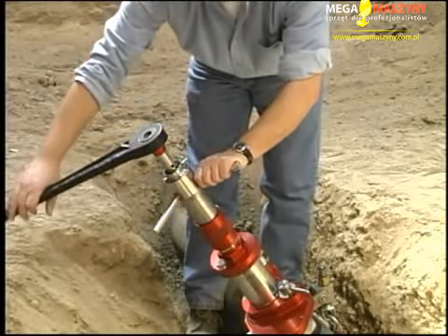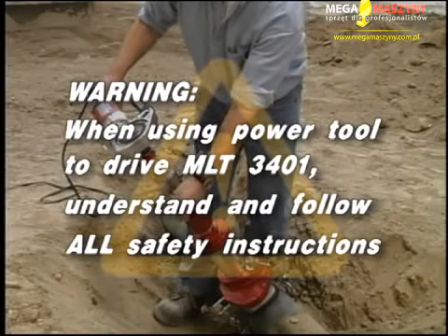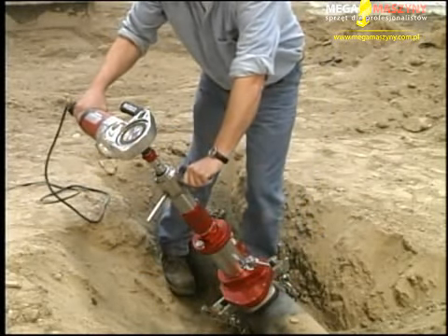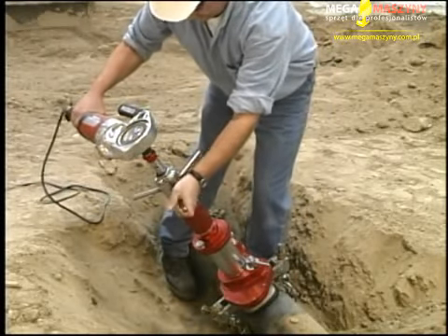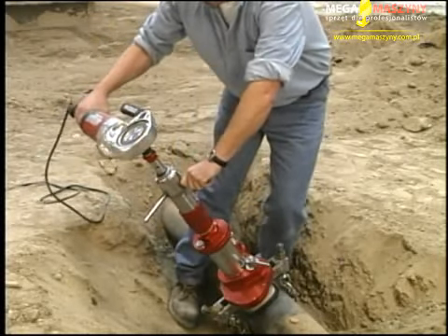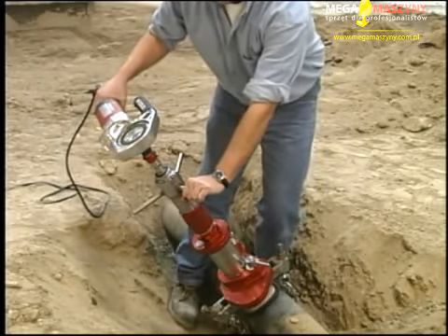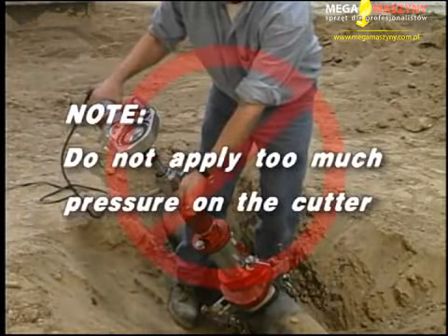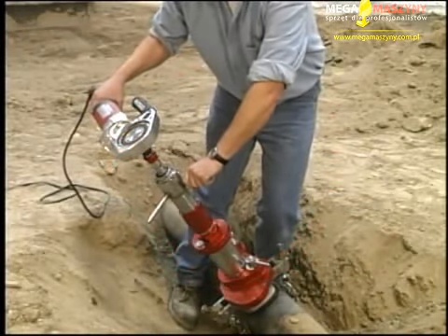Keep firm, even pressure on the feed barrel while continuing to rotate the drive shaft. Warning: when using a power tool to drive the MLT-3401, understand and follow all safety instructions associated with the power tool. Air power ratchets are generally a safer choice due to the inherent explosion and shock hazards associated with electrical tools. Only use a ratchet wrench when drilling into PVC mains. Grounded electrical tools should be plugged into a properly grounded outlet protected with a ground fault circuit interrupter (GFCI). Use only right-angle electrical drills or air ratchets to rotate the cutter, and only use power tools that operate below 100 RPM. Do not apply too much pressure on the cutter — the tool must be fed at a controlled rate. Gentle feeding produces superior cutting and extended cutter life.